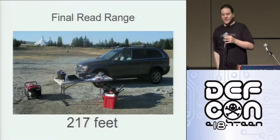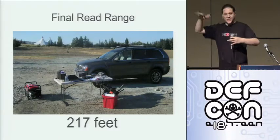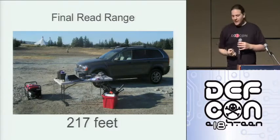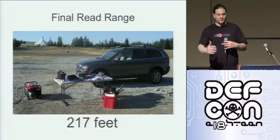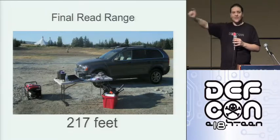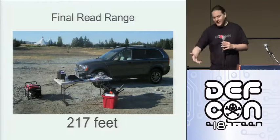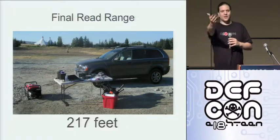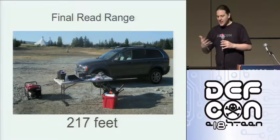That's Shoreline Amphitheater. And that's a 10-foot high steel chain link fence that runs all the way around it. As I was increasing my power to power the tags at higher distances, I was getting more and more reflection from that chain link fence. Clutter. So as I increased my output power, the signal coming back off that chain link fence increased and just swamped the tag. So clutter was the limit.